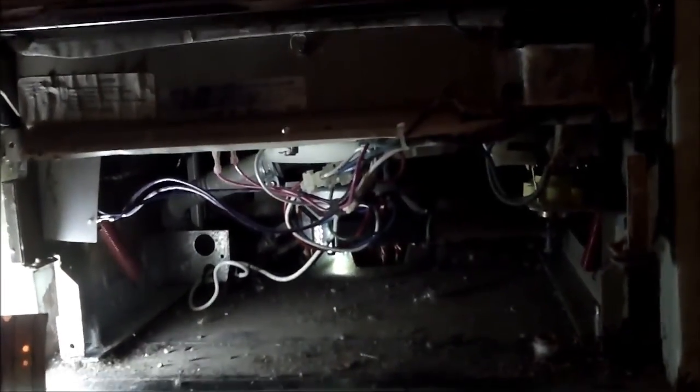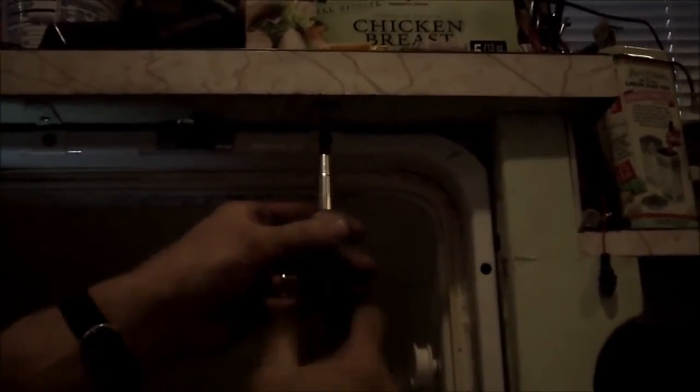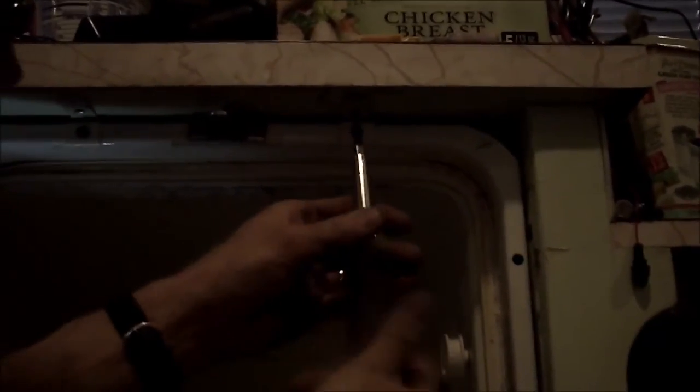Okay, now we'll go take the screws out of this lip I was talking about earlier. Now, one thing that is a very common problem when putting a dishwasher in, particularly in a new installation that's never had one, is people use screws on the lip. They're too long, and they poke through the top of the counter and destroy the countertop. So that's a big problem that is easy to avoid, but if you're not watching out for it, then you can be in trouble.